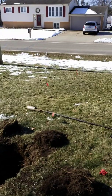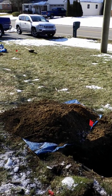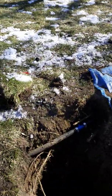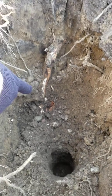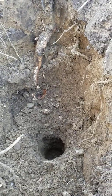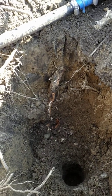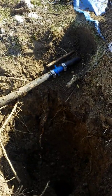Anyway, from the septic tank, sewage comes out, goes into a trench type drain field that will also be mapped out for you. The system has some limitations. It was designed to handle about 200 gallons a day. We do have tree roots growing into it that we're going to try and focus in on for you here. And you can see these tree roots growing right down into, if you see the orange down there, that is the piping for the drain field. You see it's full of dirt and roots. It's not obstructed everywhere. There is some drainage through the system, but there's enough obstruction in here that I would be uncomfortable saying it could handle more than 100 gallons a day.